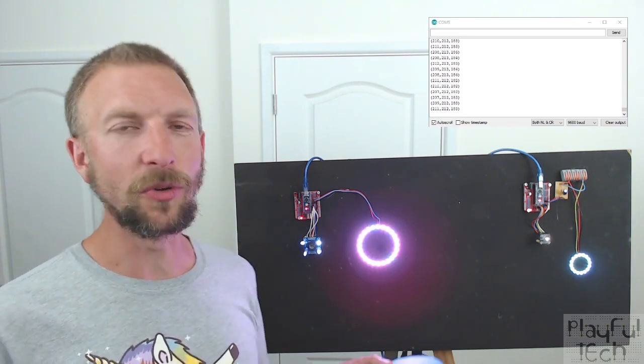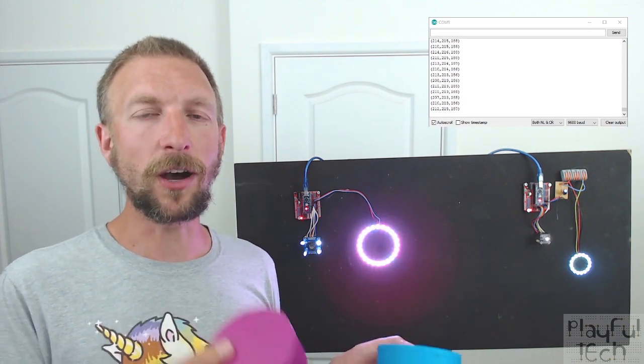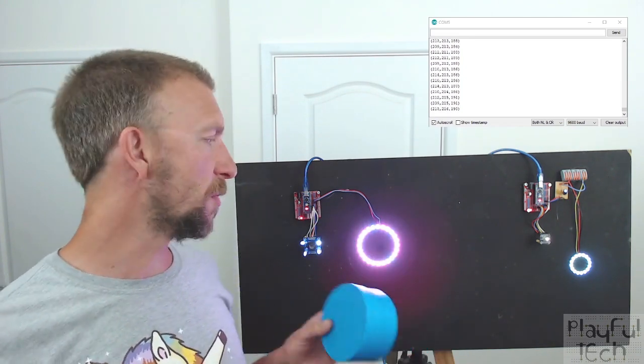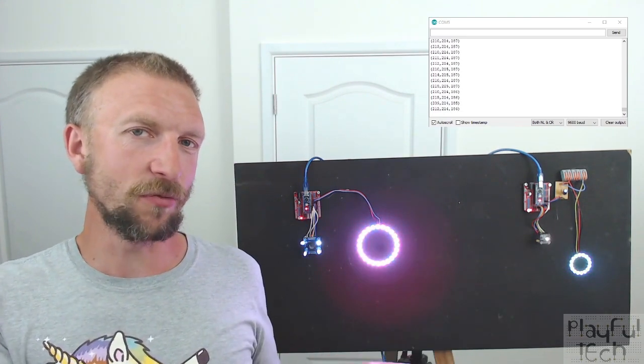The other thing is, if what you really want players to do is find a particular object in a room, there are probably better ways to detect it than relying on its colour. Normal object identification puzzles in escape rooms, where you have to place certain statuettes on certain plinths, would probably use RFID or magnets instead, which are easier and more robust than detecting an object's colour, which depends very much on the lighting of the room.